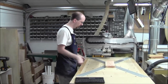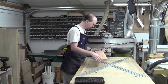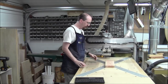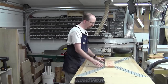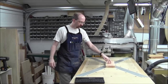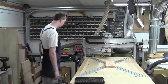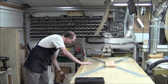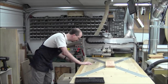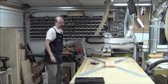All right, we've got our 2x6. I planed it down so it was at least flat on both faces, and we're just going to set this somewhat in the middle. When I do it for real, one of the big things I'm going to need to do is make sure we keep it somewhat parallel to whatever the grain is, because the spruce is going to be quarter sawn spruce and it needs to be parallel. So we'll take some of these and some clamps, and we'll put some holding to it.